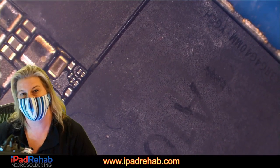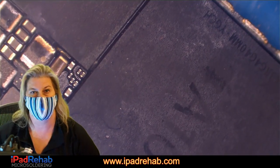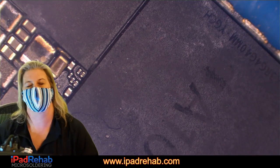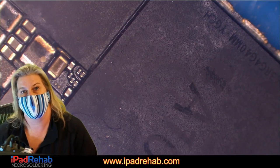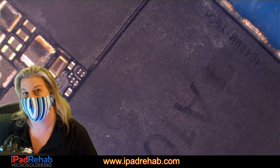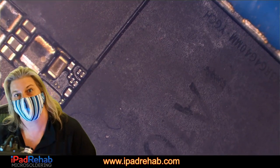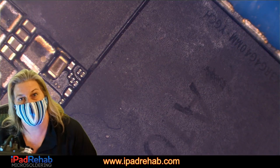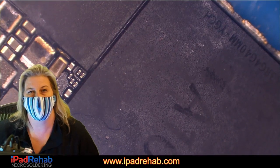If I just take the CPU off of this board and put it onto a receiver board with the NAND and the EEPROM being read and copied over, and it boot loops or does something in this really broad open-ended category, I will have no way to distinguish whether that is some sort of technical failure or if it was always like that. If I can figure out what the original problem was and solve that, and then the phone boot loops or whatever, then I have more information to eliminate that the problem was a technical problem with transfer. I don't want to throw away information.